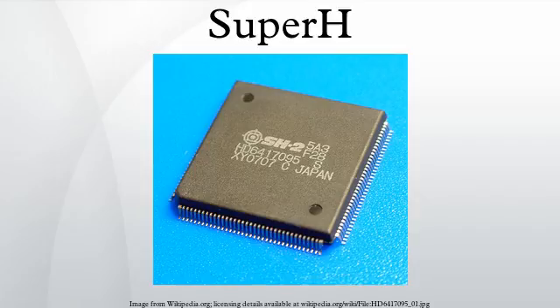The SH2 is a 32-bit RISC architecture with a 16-bit fixed instruction length for high code density, and features a hardware multiply-accumulate block for DSP algorithms and a five-stage pipeline. The SH2 has a cache on all ROM-less devices. It provides 16 general-purpose registers, a vector base register, global base register, and a procedure register. Today the SH2 family stretches from 32 kilobytes of onboard flash up to ROM-less devices, used in a variety of devices with peripherals such as CAN, Ethernet, motor control timer unit, fast ADC, and others.